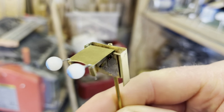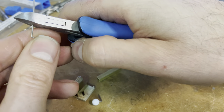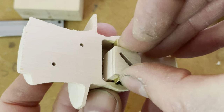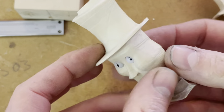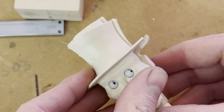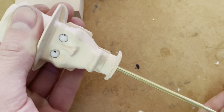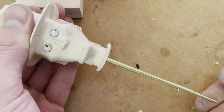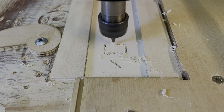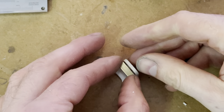The original eye mechanism that housed inside the head worked well, however they were difficult to manufacture. Keeping to the basic concept of the original mechanism, I redesigned them to be easily produced. Building and testing the parts that made up the eye mechanism worked perfectly until I brought both halves of the head together. Operating from the shaft, I felt some resistance. If the surface of the slot is not sufficiently smooth for the pin to slide, it tends to get stuck on the grain of the timber. To solve the problem, I decided to build the part out of PVC. I put it back together and it worked a treat.